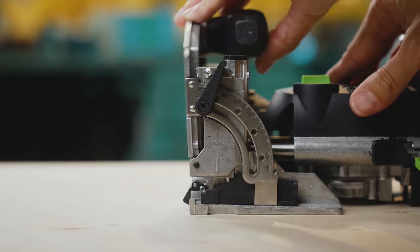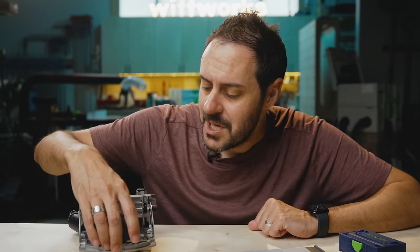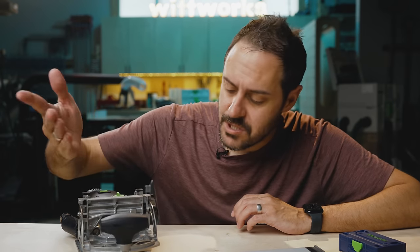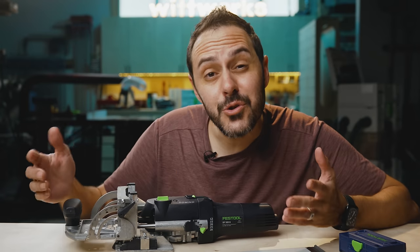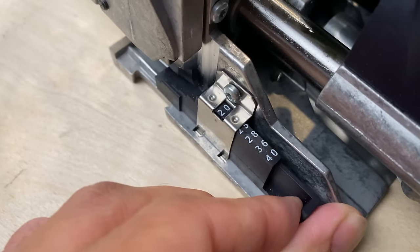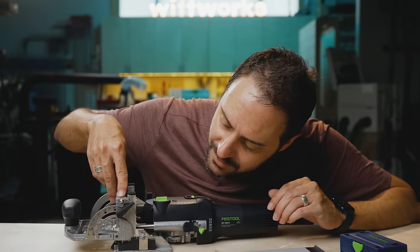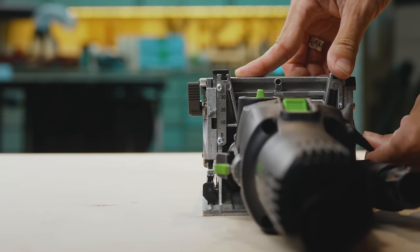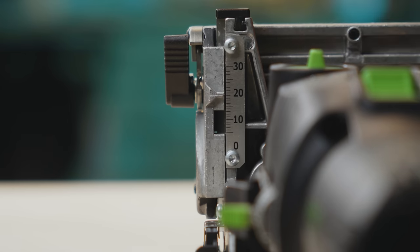The next feature is the fence angle, which is pretty self-explanatory — similar to a biscuit joiner. There are positive stops at 45 degrees and a couple of angles in between. Most beginners will use it plunging down, or in the 45 or 90 degree position. But here's where I got confused: when setting your height for your material, there are two ways to do it. The first is this quick depth stop — a bunch of metric numbers that represent the thickness of whatever material you're working on. Loosen the knob, change the setting in the window, and the fence is perfectly centered on your workpiece. If your material is an odd thickness not represented in the quick stops, you can use the gauge to dial in the right height — but be warned, that removes some repeatability.